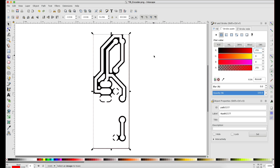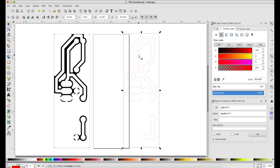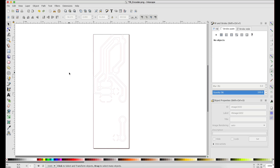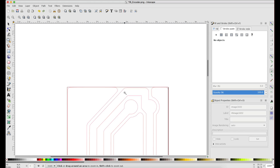I'm going to get rid of the fill, go to stroke, give it a stroke and make it red. Red on the laser cutter means cut. So that's my vector version — very thin little faint red lines. Put that back in the center of our canvas and the raster version we can just delete now. So now we have our vector version, which looks very nice and clean.